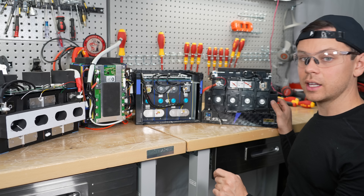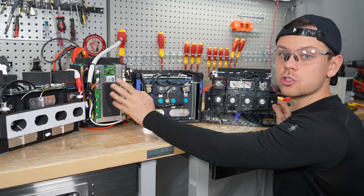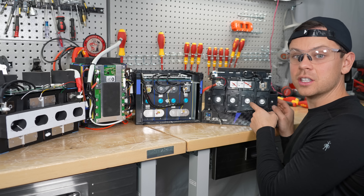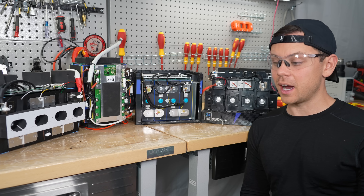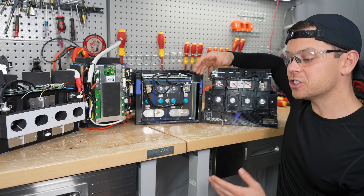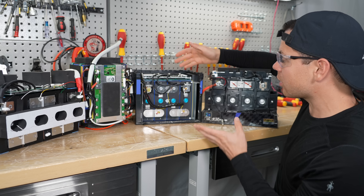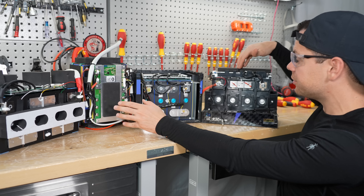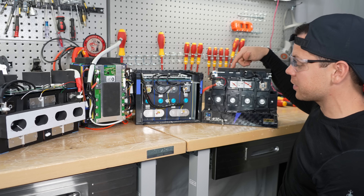I thought the EcoFlow would sell like crazy but the Watt Cycle actually sells a lot more. One Leetime that I do like that's going to be on sale is the trolling motor battery — it has a massive BMS, fantastic surge capacity, and for the price it's competitive with the new EcoFlow for trolling motor applications. Now personally I do not like 100 amp hour 12 volt batteries — for a system you should get the largest one you can to save on wiring cost. Just imagine how many 4/0 gauge cables you have to cut to wire up three 100 amp hour batteries; you're better off buying a 300 amp hour battery. Leetime and Watt Cycle have really good large batteries but EcoFlow does not — this is the largest 12 volt battery they have and they really need to come out with a 280 or 300 amp hour.